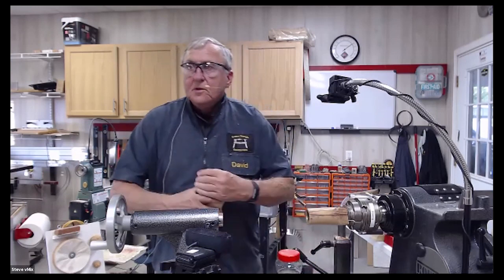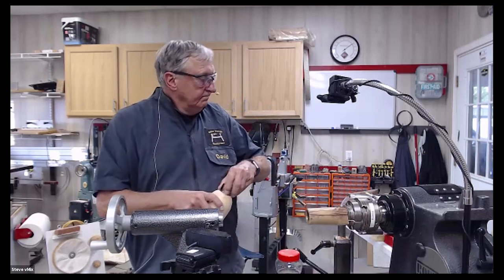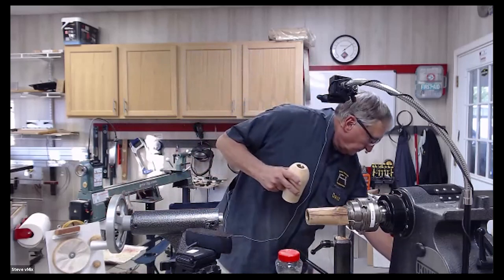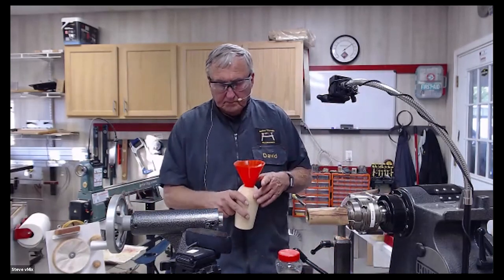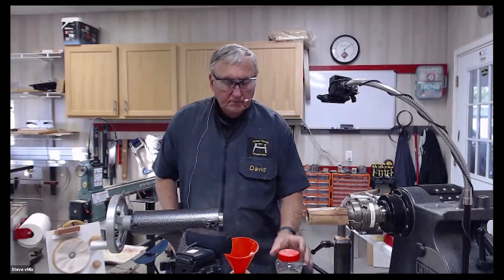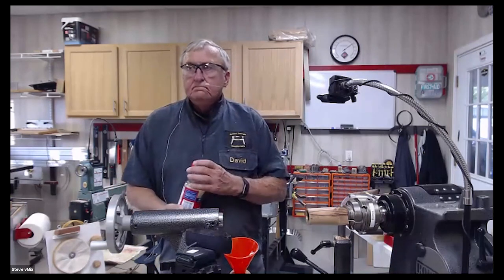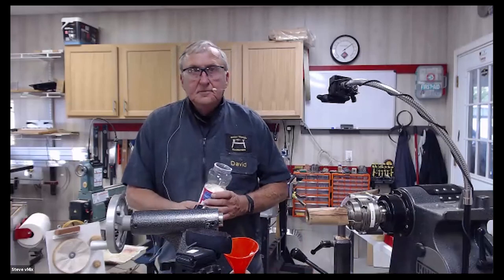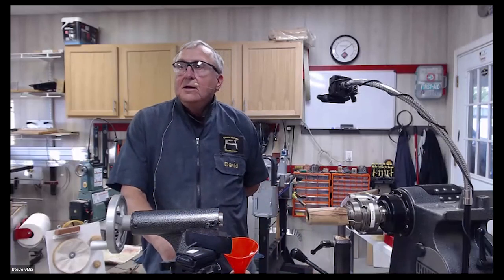Right. And so what would it have to be, Neil? For 200 cubic inches, that would be approximately what size? Well, it depends what radius you want. If you had a 4-inch radius, it turns out to be about 4 inches high. So that would be 8-inch diameter, 4 inches high, but that would probably not be the shape you'd want. You can put whatever radius you want in. If you want a 2-inch radius, so it'd be 4-inch diameter, it would tell you what that was too.